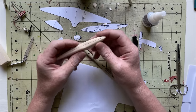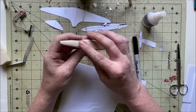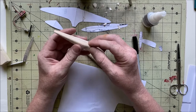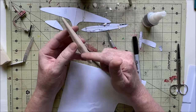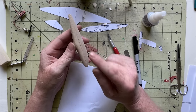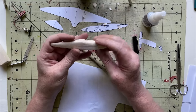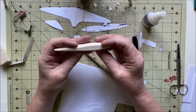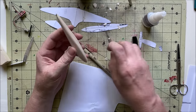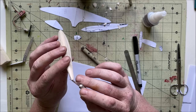it doesn't really matter. Normally, at this point, before I'd break it open, or split it in half, I'd give it a coat of paint, because that kind of helps seal the pores and makes a film on the outside that keeps it a little bit stronger, so that when you split it in half and then start carving out the inside to make the hollow, it's got a little more rigidity. But I want to try coloring this in a different way this time, so I'm not going to have that option. Actually, I have to sand the lines off before I do that. But yeah, so when I carve out the inside, I'll just have to be a little bit more careful. But hopefully, I didn't put too much glue in, although I think I did.